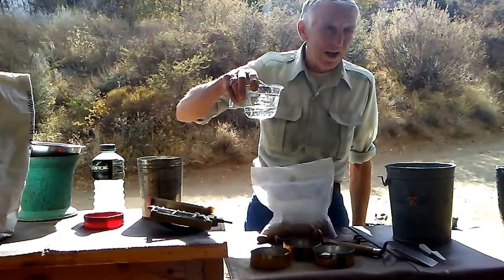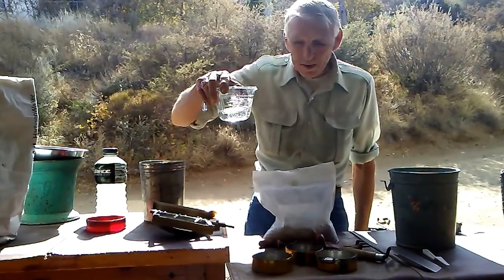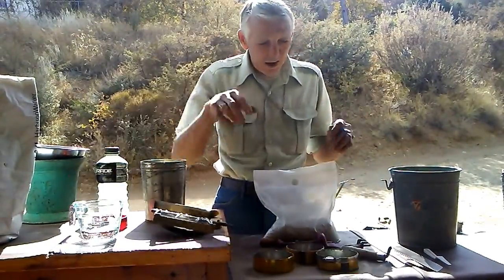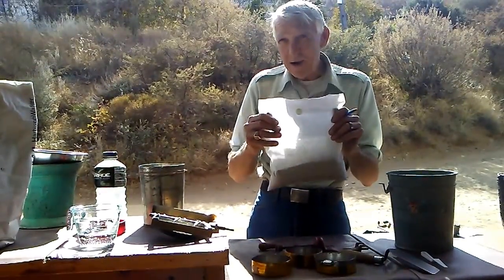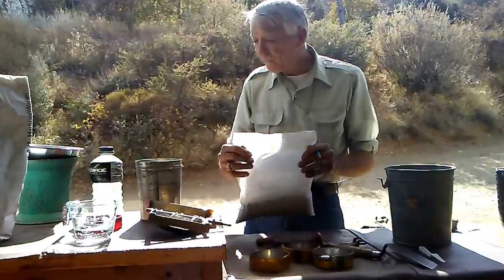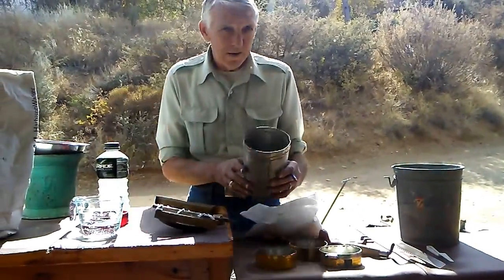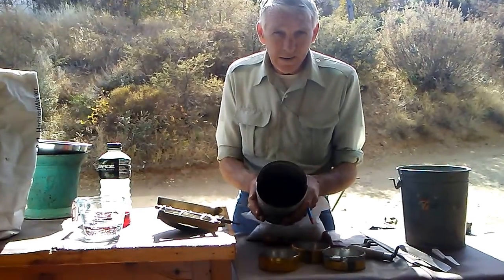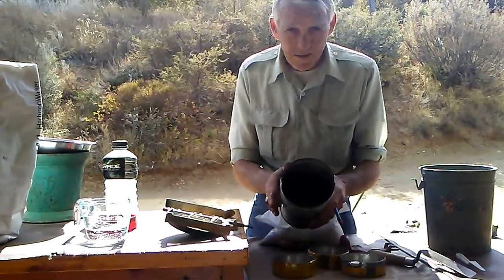100 milliliters of water. That's just under a half a cup. I believe I said 100 grams. It's really 1,000 grams of your refractory. Now we have the paddle mixer. We got the water, the 100 milliliters of water already in the ice cream freezer.